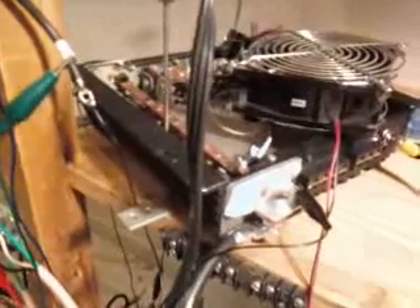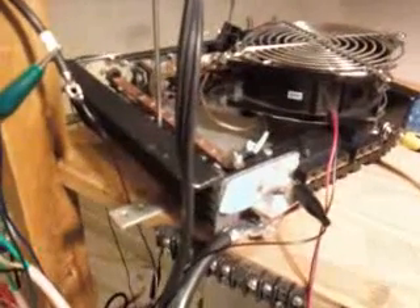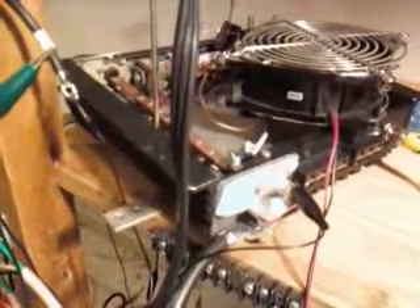So we've still got to solve some issues with this positive bus. This is all because of the energy that's backing back up into the unit because of the blocking diodes. We've got some battery cables here — these are actually fairly heavy battery cables — and these were running very hot. You can still touch them, but they were fairly hot, even running 60 to 100 amps. So we definitely need to have very large battery cables on these kinds of units that are running high amperage.